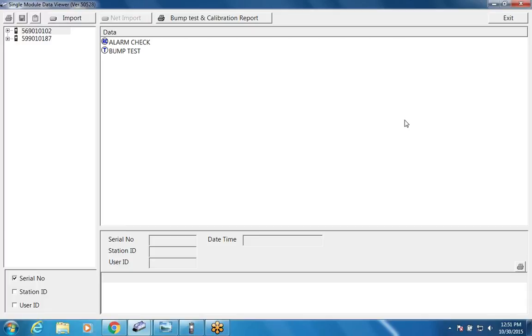John's got a question about calibration. Okay. Calibration time is different on the dock than the unit. Yes, that's correct, John. Unlike our other instruments, you can actually override what the instrument settings are with the settings on the docking station. So the docking station settings are what the unit will go by when you're doing a calibration.